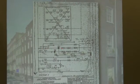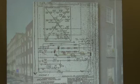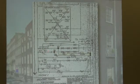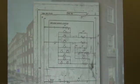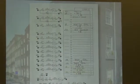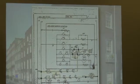X5, we probably wrote it up as DGX coil, DGY coil, or maybe DG3, DG/3 contact or DGZ/3 contact. That may be how we run it up. But I think the key to these paralleling circuits is a pretty simple operation. The key to this is breaking the circuits. There are only a few of them, but we have to break them clean.